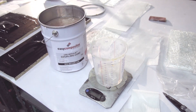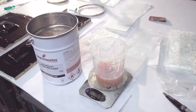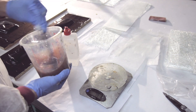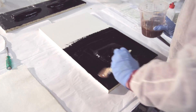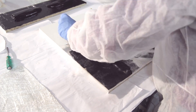The second coat is a coupling coat, just to avoid print-through the gel coat and get a nice bond between the gel coat and the tooling resin as the last layer. I'm mixing around 500 grams and just lay one coat onto the gel coat.